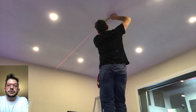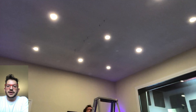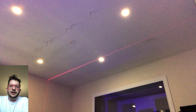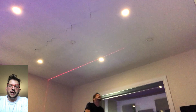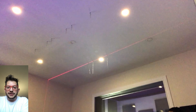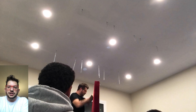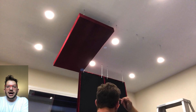Now we're getting ready to do the control room mixed-position clouds — this is way easier to see us using the laser level. In this case we're centering to the middle two pot lights, which are the center of the room. We do all of our centering visually to make sure there won't be any weird visual inconsistency in how the clouds are mounted. We got our six rear anchors installed and now we're going forward by 48 inches to get our front anchors installed. These front anchors will have longer chains to give us the angle where the mixed-position clouds are angled lower — closer to the vocal booth window — and closer to the ceiling towards the rear of the room. We're measuring 18 inches between each anchor and six inches between each cloud.